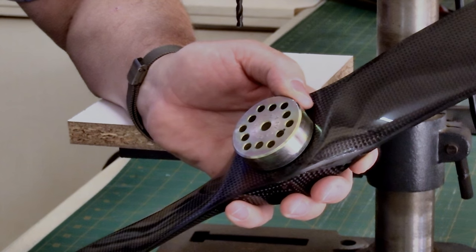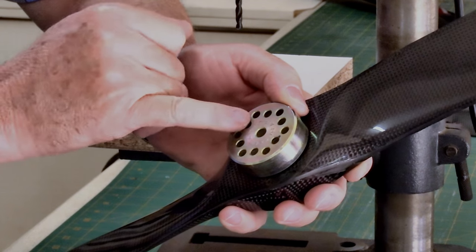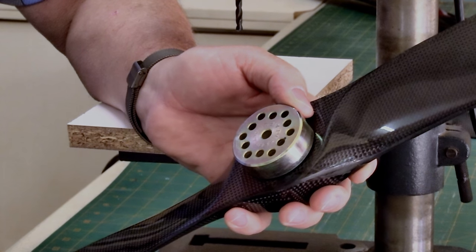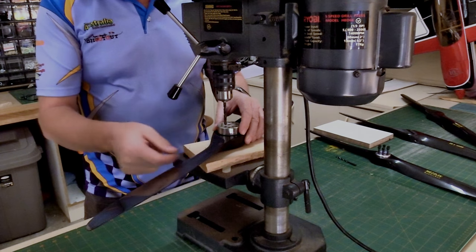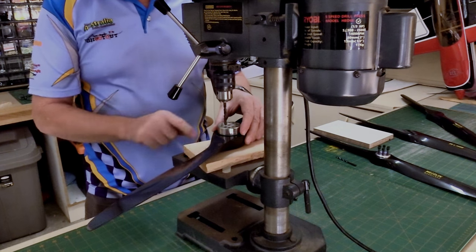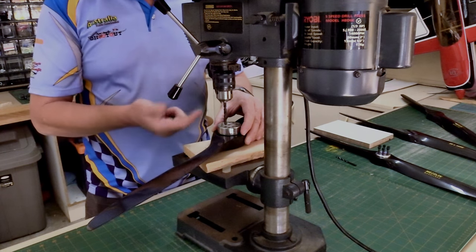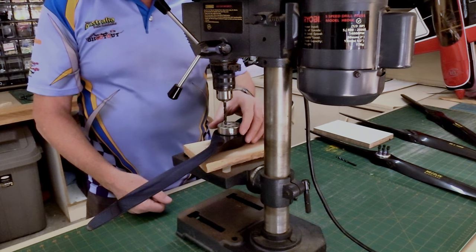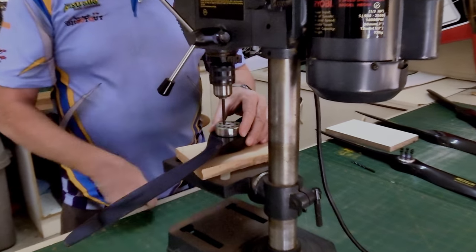That's where we'll start — I'll drill this hole first and put in a peg, drill this hole second and put in a peg, then I'll drill halfway through on these other four holes, and then we'll flip it over and do it again. You'll notice I've changed my piece of timber — the other one was just slightly too big and it was catching the edge of the propeller and made it rock. You want a nice flat surface for it to sit on before you start. I've lined up my jig — you can use a bolt from behind but it's not necessary in my opinion. Just hold it with your thumb and forefinger, pinch it together, and push your hand down on the propeller.